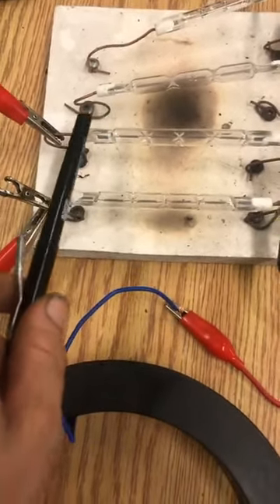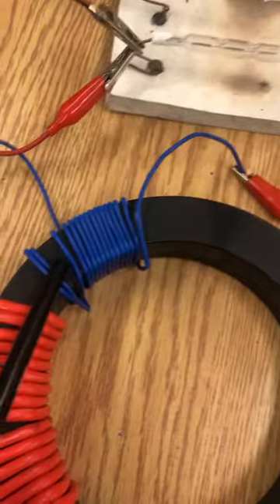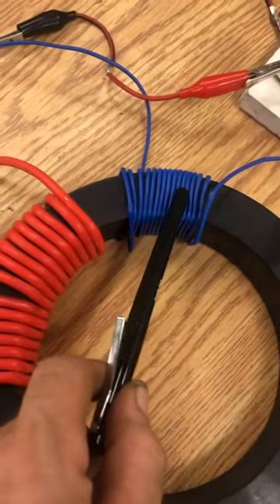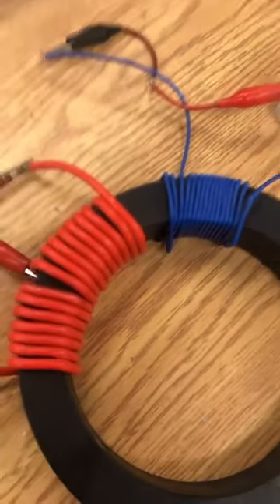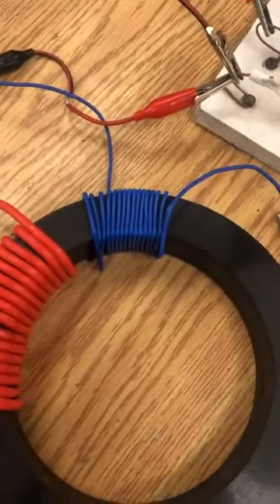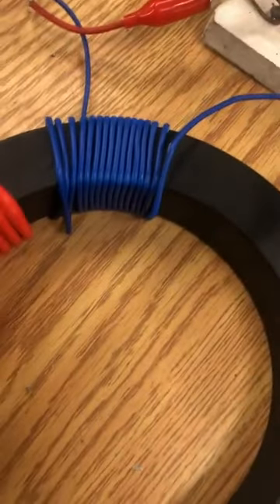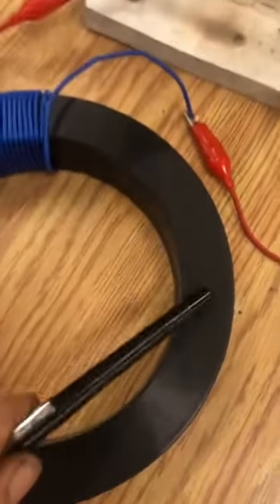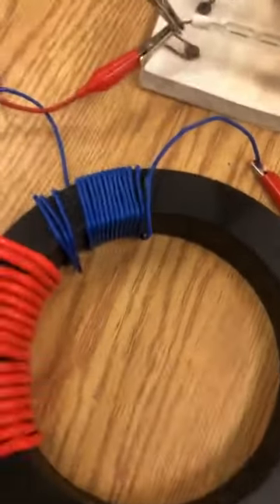Up to 1,000 watts, just this coil — no autoformer hooked up. There's a harmonic relationship here: this wire is twice as long as this one. This is Tesla basic tuning 101. If I take what I did here with four different harmonics — eight foot, sixteen foot, thirty-two foot, two foot — you can see the results.